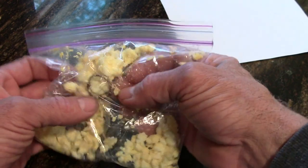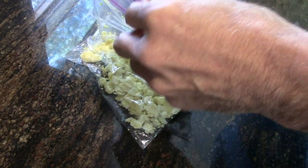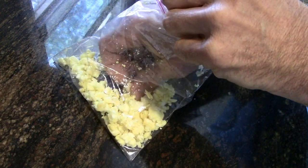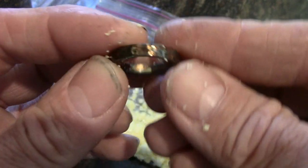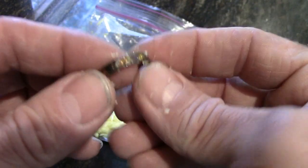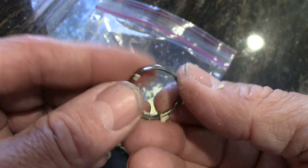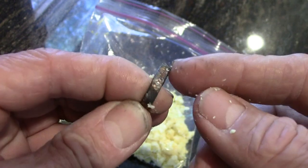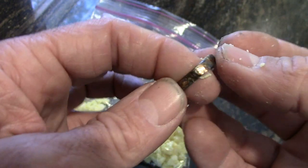Back to the patina — it's getting darker and darker. We're on about 15 minutes in the bag — this stinky, sulfurous-smelling bag. Look how dark that got. That's a really pretty patina. If I let it keep going it'll just keep getting darker, but I kind of like it where it is. You can still see all the shininess of the polishing. Now you could take this, polish and sand it more, and all the high points would go back to a silver color, while everything that's hammered and indented would stay that patina color, which would give it even more character.